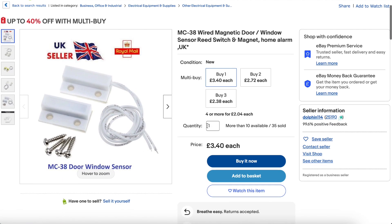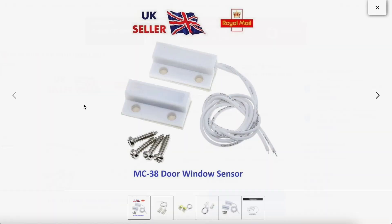And there we have it — a homemade garage door controller. If you didn't want to buy a wireless door contact sensor, you could take the project a step further and use a cheap magnetic reed sensor wired directly into the microcontroller. You'd need to adjust the configuration to present that sensor as a contact sensor in Home Assistant. I'd already got the Zigbee sensor on the door so didn't need to do that, but please share if you decide to go down that route. I'll put the configuration and wiring diagram up on my website — the link will be in the description. I hope you found this useful, and if you did, please give it a like and subscribe to my channel to see more videos like this.